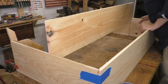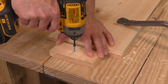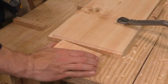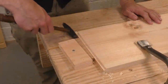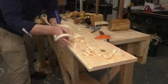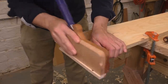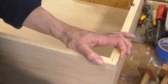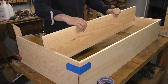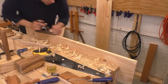When I go to install the shelf, it fits the dados but it's very tight — this is going to help make the whole piece solid and durable. I need to make my second end piece. I didn't end up loving that batten trick, but here's another one: screw a block of scrap close to the workpiece so that it's free to rotate, tap in a hardwood wedge, and the piece is held so tightly you can get rid of the holdfast. It's like a poor man's tail vise. Now I've cut the top piece and I'm rabbeting it for the plywood back and rabbeting the end. When I go to assemble, those rabbets will fit together like puzzle pieces and give me a square joint with plenty of glue area. With the outside pieces all done, I tape them together and test fit the shelves.